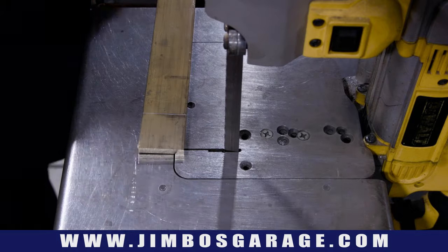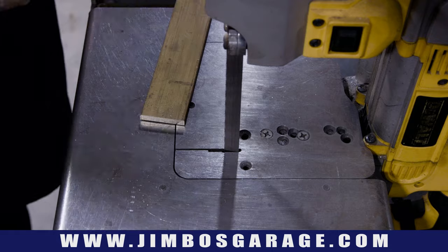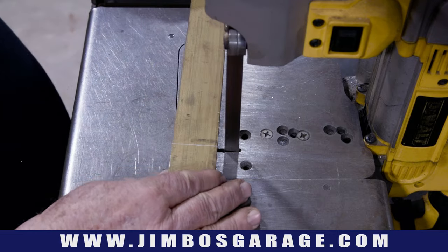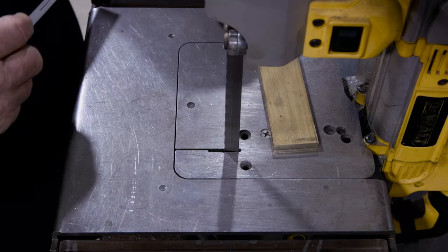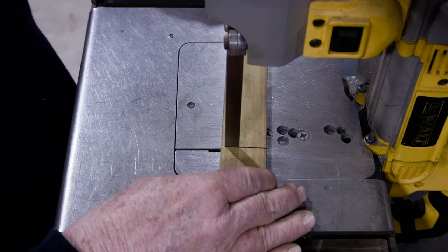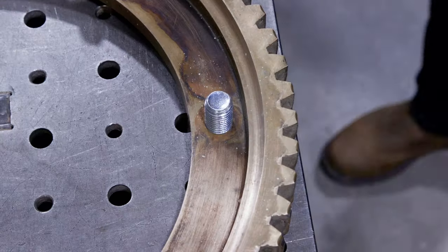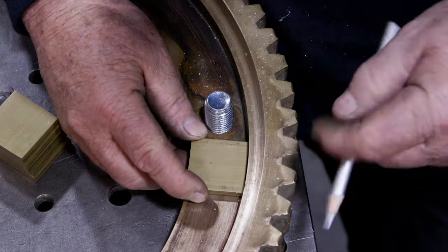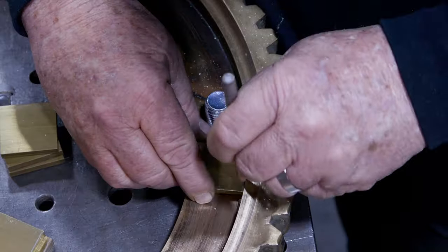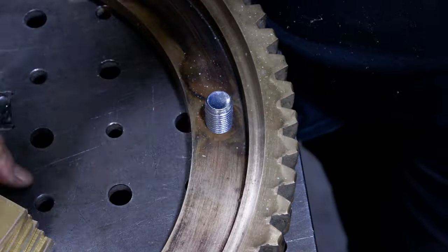These pieces are about an inch and a half long — these are going to be the tabs. I'm cutting this off right now and I will be welding these two pieces together once I get everything cut. I tried to bend this off camera — no good. Brass does not bend well, at least this thick of brass. So here are the little pieces. There is a little radius there to that ring gear, and I'm just going to mark that and grind it down so these pieces fit nice and flush to that radius inside the ring gear.